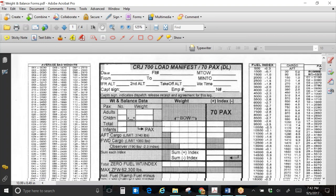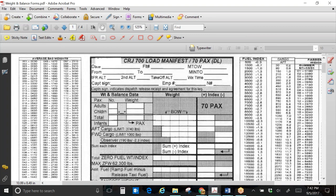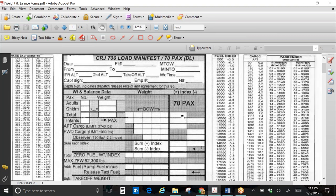So what I was going to say, going back to when they do football, we do a lot of football charters, but a charter is a 135 operation. A lot of times we'll get notification that we're going to be doing a charter for UCLA. We normally don't do the football team, but sometimes we carry the equipment and the cheerleaders on our planes. If we are doing a charter, Part 135 operations does require you to weigh everything. You weigh the passengers, you weigh all of the baggage and equipment. But in 121, you don't have to do that. So you'll see the differences when you actually do it. But there are occasions where you do weigh everything and get an actual weight.